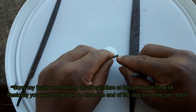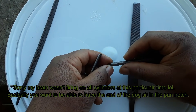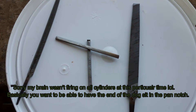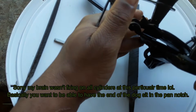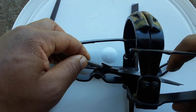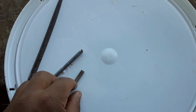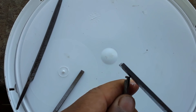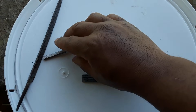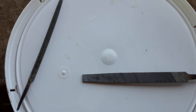Say you've got about a quarter inch coming off the back of your notch on the dog, but there's not a quarter inch of room left in the pan — that's not gonna work. If you've got a quarter inch coming off and you do not have a quarter inch of space back there, it's just gonna hang back there and you're not gonna get that hook-up you want. So make sure you take your file and make some room back there for that little leading edge of your dog, or take some of that material off — you want it flush. You don't want any extra overhangers or the whole deal is not gonna work, or it's gonna work very poorly.